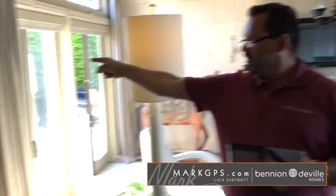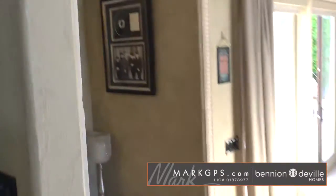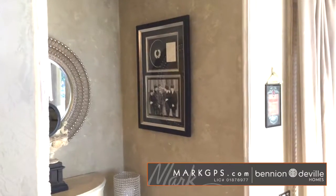Here in the sub panel, there's a sub panel in the hallway behind that Beatles picture right there. When you open that panel, there are multiple double tap neutral wires. Inside of an electrical panel, there's usually a strip of screws. It's called a lug strip. And there should be one white wire going into each lug. You'll see in the picture that I sent you, there's more than one wire. There's two wires going into multiple lugs, leaving some empty ones there.